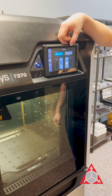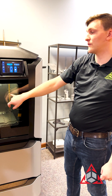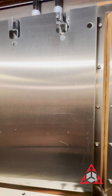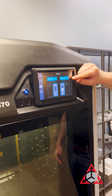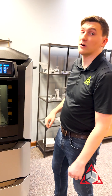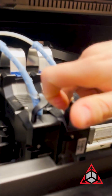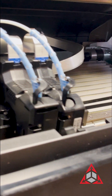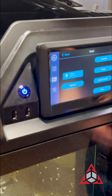We are at the head, and you'll see this blue line indicate that it is still feeding up for the load. It's going to climb now to its target extrusion temperature of 265 degrees Celsius to purge. You'll be able to see that purge at the back — if you look carefully, it'll be just above the shroud. Once you see a solid blue border for your head, you know that you're loaded. We saw the purge while it was purging, so we can confirm. If there are any doubts, you can repeat the process — opening your lid, bringing your heads forward, going into your head, then maintenance, enable, and purging again.